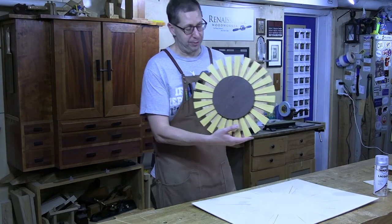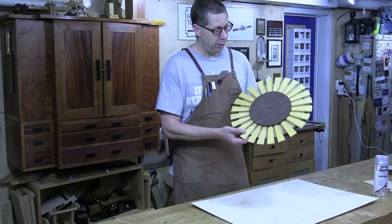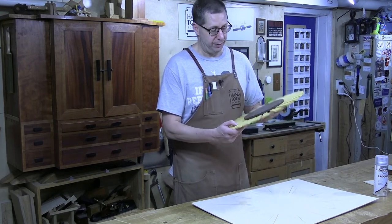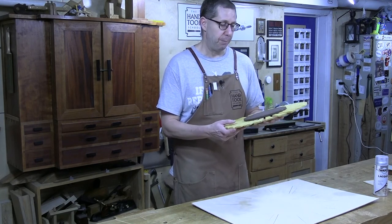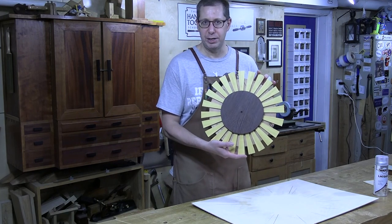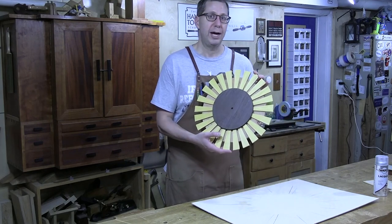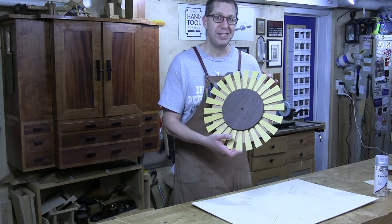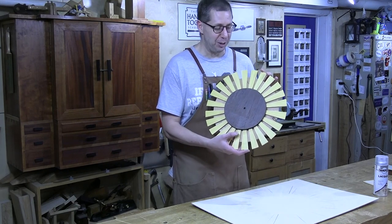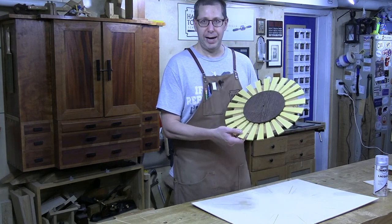We have a sunflower clock — holes are all lined up, everything's glued firmly in place, and I'm ready to apply a finish. I did a quick test to make sure the clock feeds through appropriately. For small keepsake items like this, the finish doesn't need to be very durable. I'm focused on something that looks good but dries really quickly — since it's Christmas time I tend to be behind the eight ball. I'll choose something that dries fast, generally shellac or lacquer.